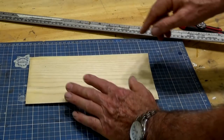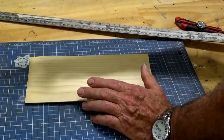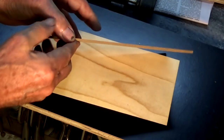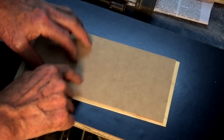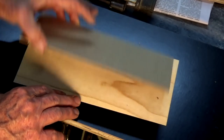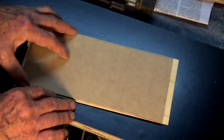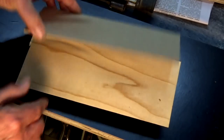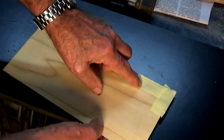So that's going to be our balanced veneer — we'll get that bonded down, then we can laser cut through. There is a split there I didn't see before — we can tape that together, and when it's bonded down the tape comes off. Remember, this is the back, so I'm not going to fret too much about it. The veneer we put on the back side doesn't have to be high quality — grain pattern is really not that important. The only reason we're putting veneer on the back is to balance the shrinkage caused by the gluing and veneering process. This piece had a split in the corner, and I've held that together with some masking tape, making sure the tape is on the outside when we glue it down.